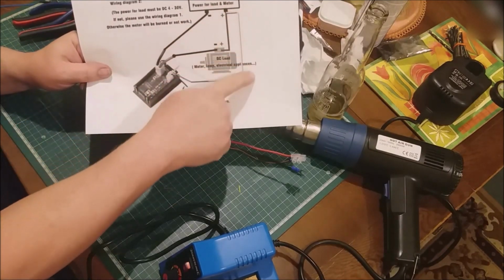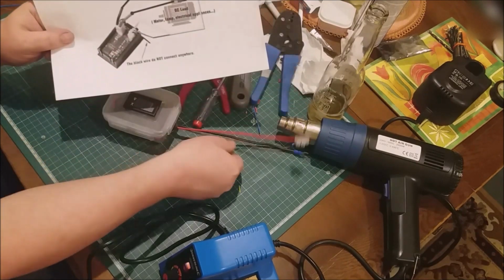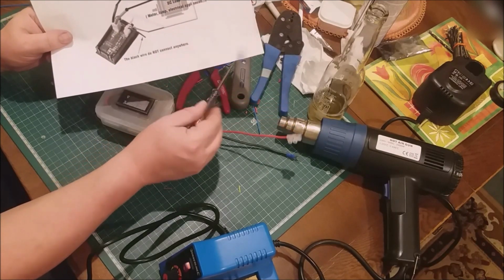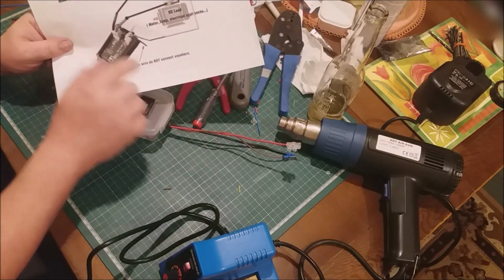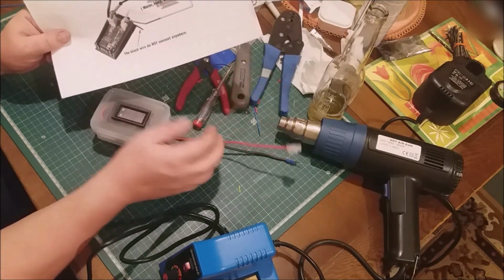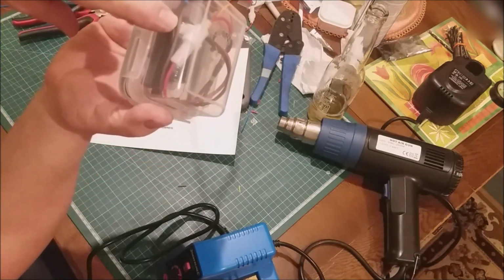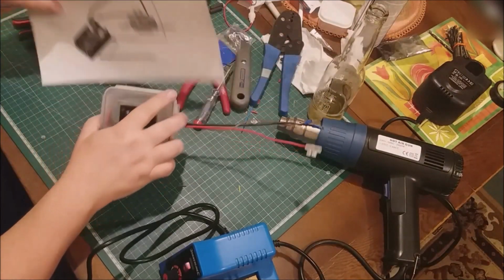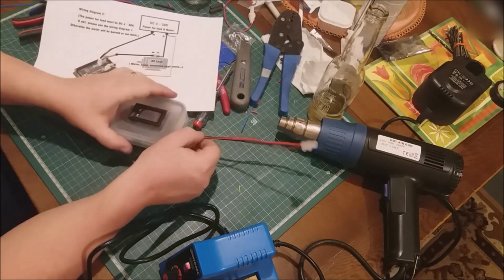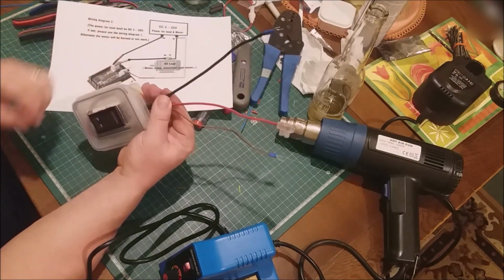So that wire there from the plus of the power supply, that is that brown wire there, which needn't be so thick because that's basically a supply for the voltmeter side of things. That's the voltmeter in, and I've got that fused down at 50 milliamps internally in this box on that white fuse holder there, to protect that side of things. And then I've got the neutral, which is a much thicker cable capable of taking at least the rated load that we're talking about, 10 amps.